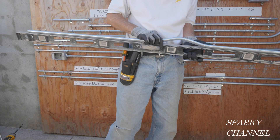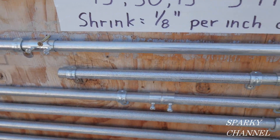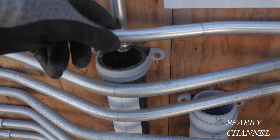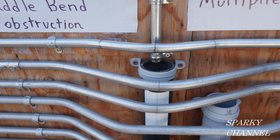That's it — let's test it again. Very nice, right on. I cut the conduit with a bandsaw and installed it. It goes right into the fitting, jumps up over the obstruction with a little clearance, and connects to the fitting on the other side. Notice the middle mark on the conduit aligns with the middle of the obstruction — that's because I added the shrink. It was only an eighth of an inch, but it makes a difference. The marks on the conduit are made with grease pencil and clean up easily. I'll put links in the video description for the tools used. Thanks, I hope this video was helpful.